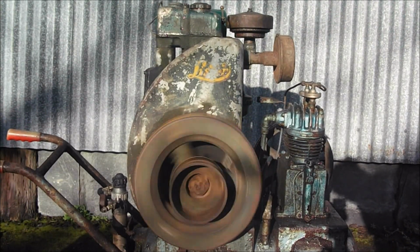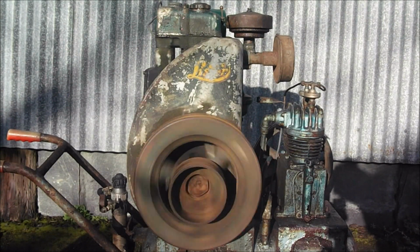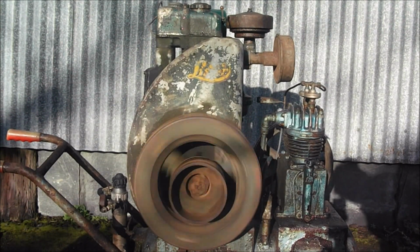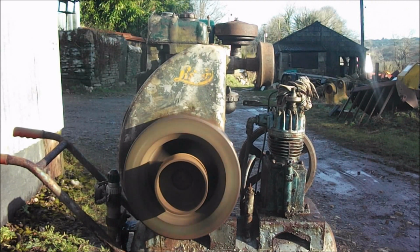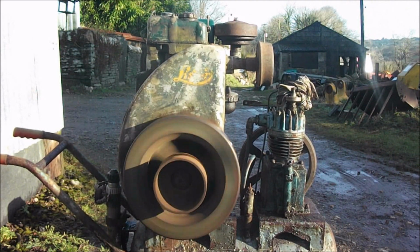Try and adjust the excess fuel, because I think he's constantly on excess fuel, right? That's why he's smoking. It's a bit better, but I think the pump timing's a bit out, because I slowed the engine down and never bothered taking the shims out.